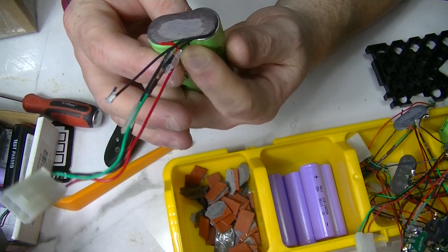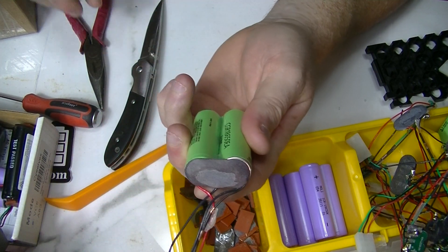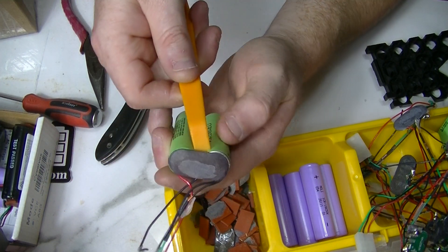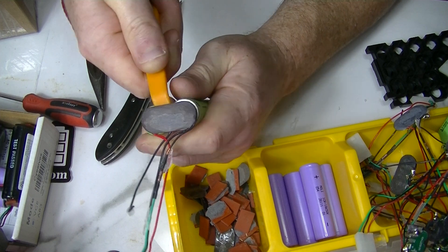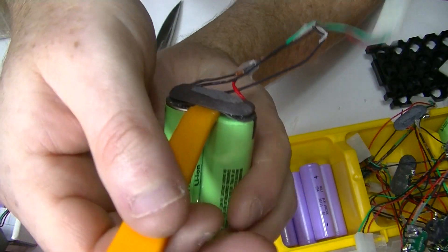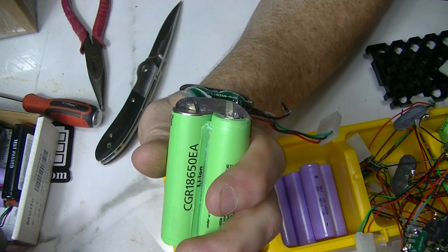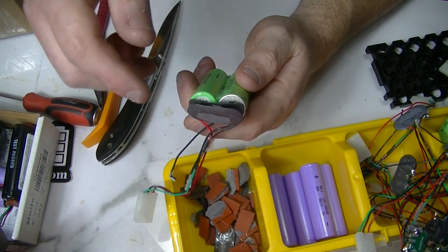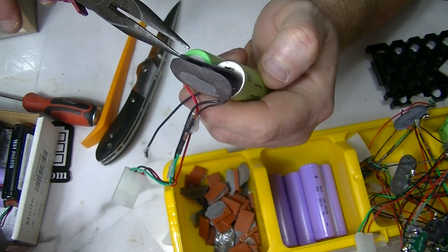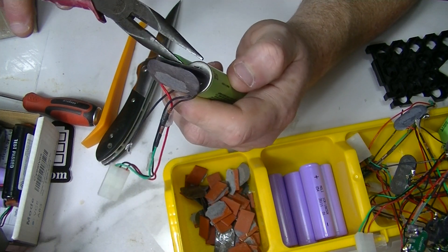What I've been doing is putting the wires that are coming out the back of the BMS down towards my finger. I have a plastic scraper tool here and I just slide it in behind the BMS, fold it up - that way you don't break the BMS or short anything out because it's plastic. That exposes your terminals underneath, then just put your pliers on there and rip that out.